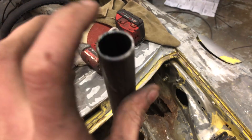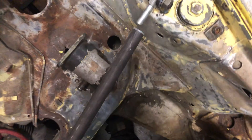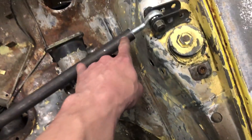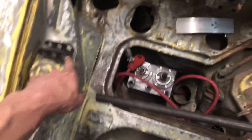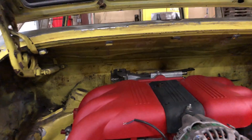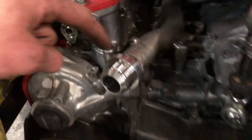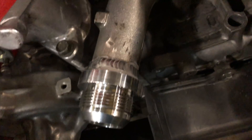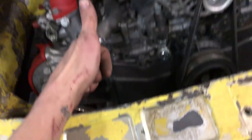So this is the bar I'm using — it is a one-inch by 0.065 tubing. I need to buy some nuts to weld onto the end and then some jam nuts for each side, but basically it sits like that. I'm probably going to go from here over to there and same thing, boom to boom. That's just stiffening up the front of this thing really well. In the middle of doing everything at once, I welded these on — boom and boom. I did a pretty weld there. Look at that guy. He's a good guy.